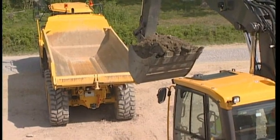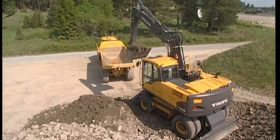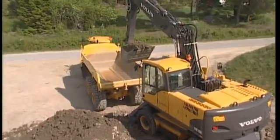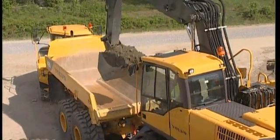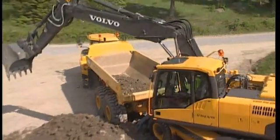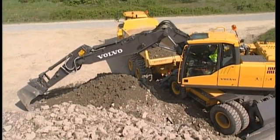Raise the filled bucket into the air where you would like to empty it. This will assist the truck driver in finding the position faster. Use the horn to stop him. Dump the first bucket close to the truck body. If you dump the bucket too high, the material will hit the body hard and cause considerable wear. It could also be very uncomfortable for the driver in the truck.